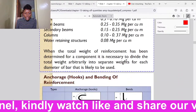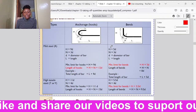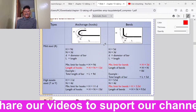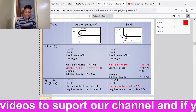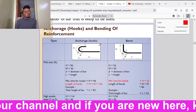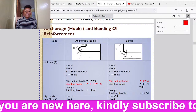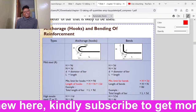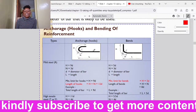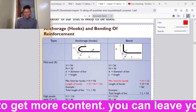All right. So when we go to reinforcements, reinforcements are usually done in different shapes depending on where they'll be used. There are usually basic formulas for calculating the length of reinforcements that you shall use. For example, when we are doing things like slabs, we need to use hooks when we are joining reinforcement bars so that they can be held together.